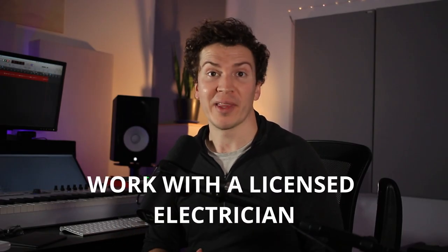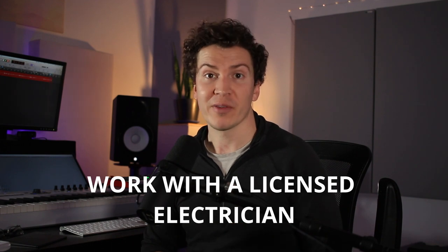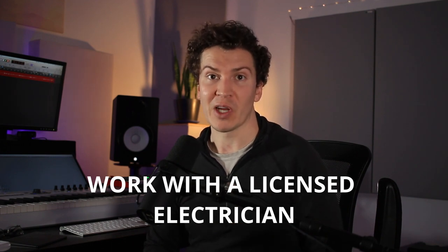The first thing I'm going to say is right off the bat you should work with a licensed electrician. This should be one part of your team when you're building your soundproof studio. Even if you have some electrical knowledge, you're going to want to talk with someone who knows codes. As an individual homeowner you cannot pull a building permit from your city if you are not a licensed electrician. If you are a licensed electrician, then awesome — you can do this on your own. I'll teach you a little bit about the soundproofing side of what you have to think through with electrical systems so you don't get buzzes or hums that can be really annoying down the road.